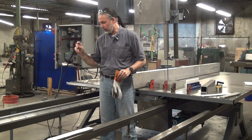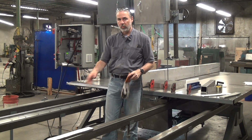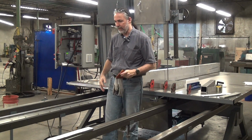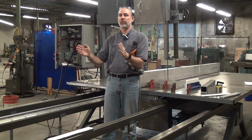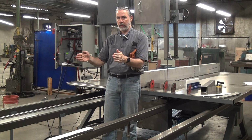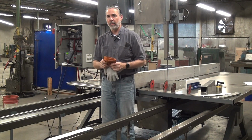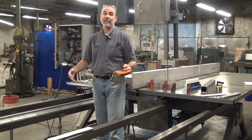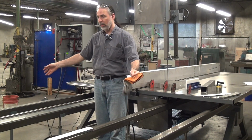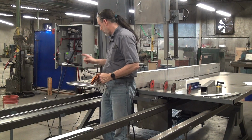The trick here is we just had the one rail with linear bearings. If you put this on multiple rails, you have the issue of keeping them all really precisely parallel. If it goes this way or this way, the table will bind up. By having just the one rail, precision mounted, it gives you a lot of latitude. You can't be sloppy, but it gives you a lot of latitude on positioning the other rails, since they're just supporting vertical load, not trying to guide.